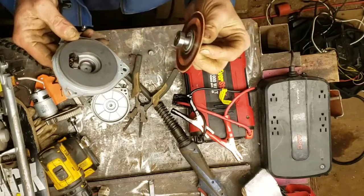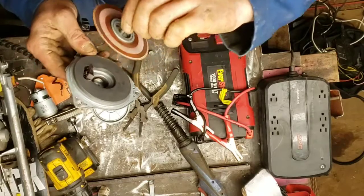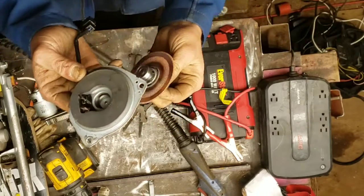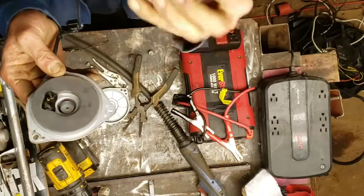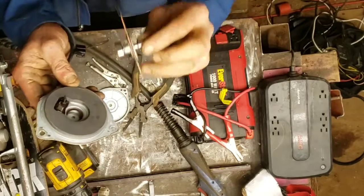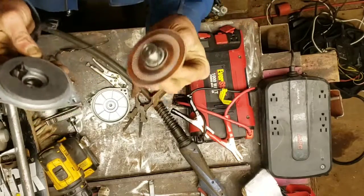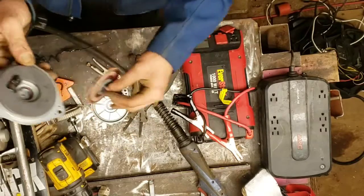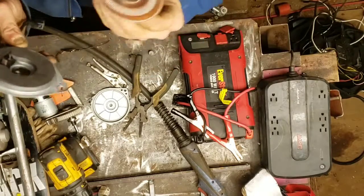But for a wind generator, even though it's got brushes, this thing spins freely. There's no metal on the rotor. It's a rotor on the disc here. There's no metal, so there's no iron, so there's no resistance like any other DC motor. When you spin it, you can feel the change of the poles on your rotor. This one doesn't have that. None at all. And when I spin it with the drill running this motor, it almost doesn't have the feel of every other generator.